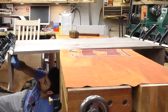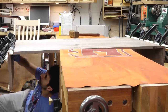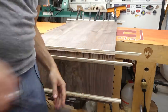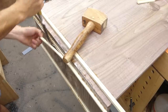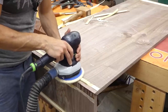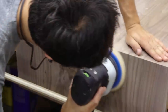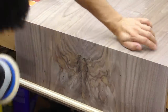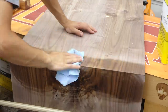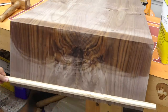A quick double check and some squeeze-out cleanup before leaving this thing alone to cure. Since they're no longer needed, I can have a little destructive fun and remove the cauls. I'll split them along the ply closest to the face veneer, and the remainder is removed as I'm cleaning up the joint. This leaves me with a very crisp and tight joint, and I'll use a little bit of mineral spirits to check for any glue residue and to get an idea of how this waterfall is going to look.